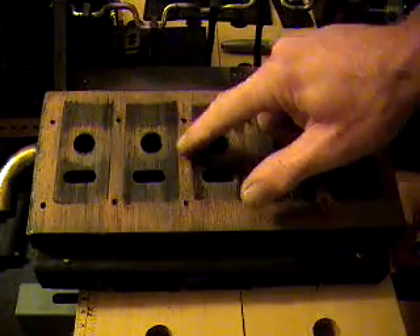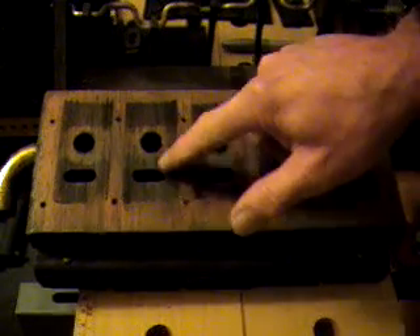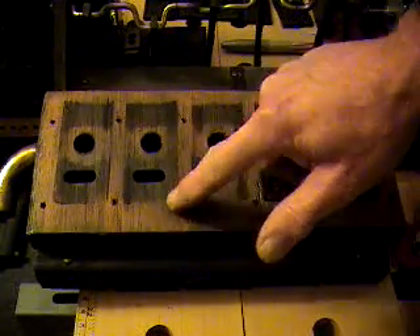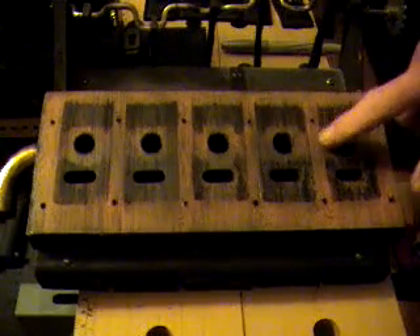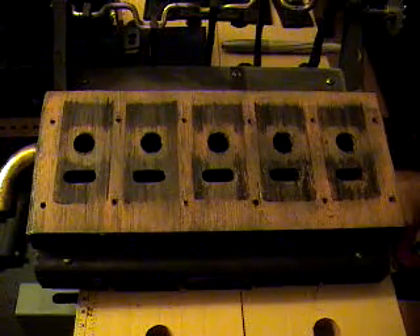That's because they don't have an adequate amount of graphite on the motor, which would help prevent this stickiness, although that's not the main problem. This motor was sent to me because it's leaking — leaking so badly that it's bringing down the entire system in the player piano. I tested it and could tell immediately it was leaking like a sieve.